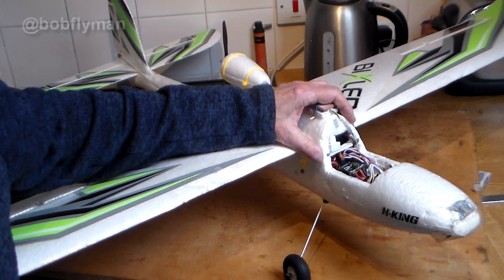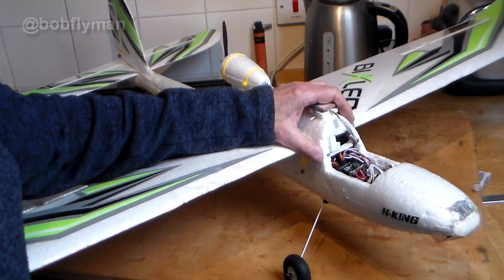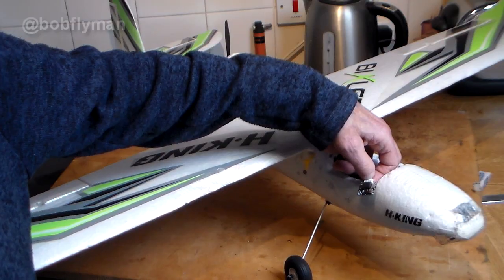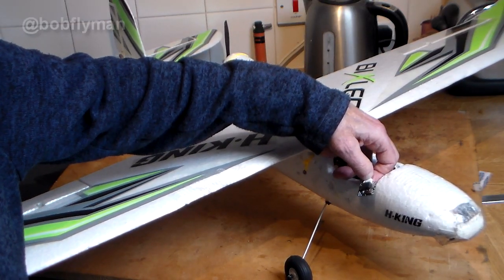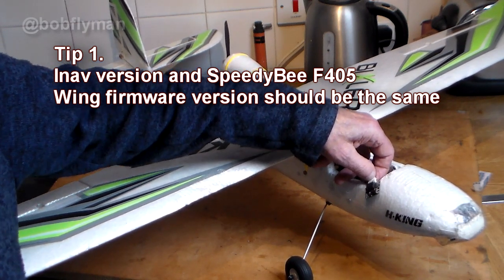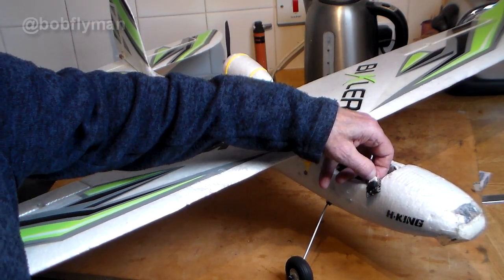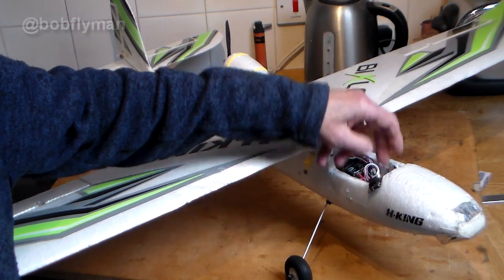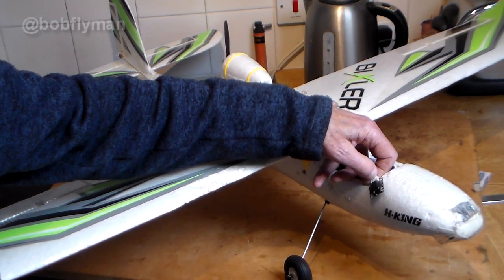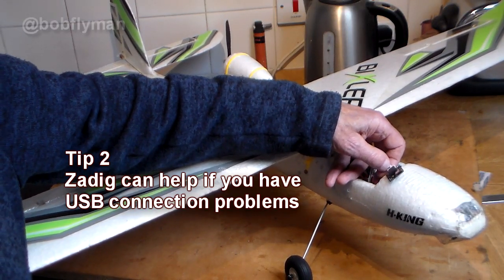Let's get on to the problems I had with actually getting this to talk to my PC, which certainly wasn't as easy as it appeared in the many videos I watched. The idea is you just plug in a USB-C, install the iNAV software — and on that subject, it is important to use the same iNAV version as the firmware you're going to install on the Speedy B board. I picked version 7.1.2 and that's the firmware that's on this. But it's not as simple as just plug in the USB-C and bingo — you need a data cable, not just a charging cable.